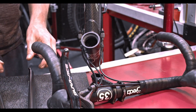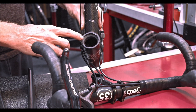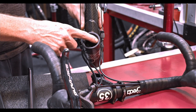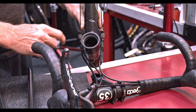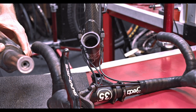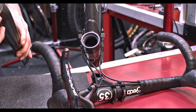Okay, next step will be to make a new crown race to suit that bearing and make sure everything's right. What's happened by this being damaged in the first place is that the depth from the outer rim to the inside bottom of the seat — the taper — may not be the same, and we're not sure how deep it needed to be from factory because we've got no original measurements to work with. That's why we will make a custom crown race to get the tolerance between the top of the fork and the bottom of the headset to be the correct distance apart and make it look factory.